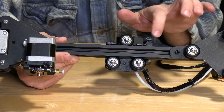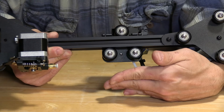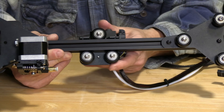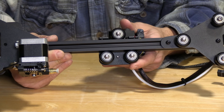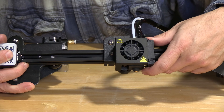That nut moves this wheel in or out of the rail to increase or decrease pressure against these wheels. By pushing or pulling against this rail, these wheels will push or pull against the opposite rail, making this entire contraption looser or tighter. Doing that will make this movement stiffer or smoother and will also make the actual hotend itself more stable or more wobbly.